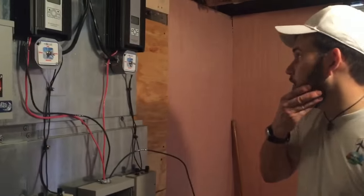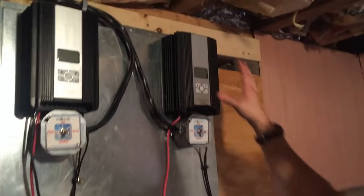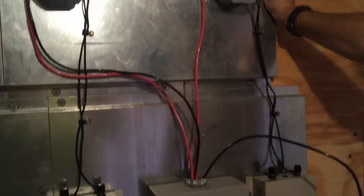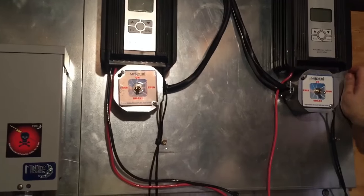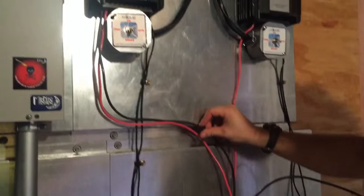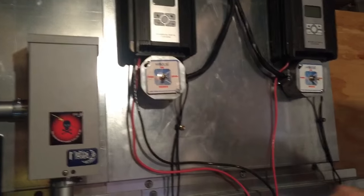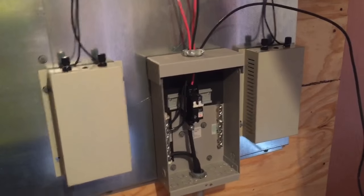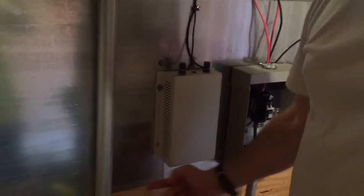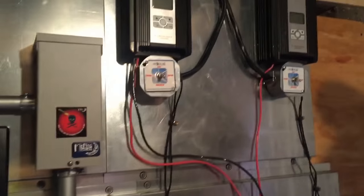Now, what we've got going on right now is we've got both our charge controllers wired and our brakes are on. As you've seen on the roof, turbines are in good shape. We'll tighten these down and lock this down. Our dump loads are in place. I'm putting the last wire up here — you've got your hot and ground coming in, and here it is to our lugs. We're going to take a ground, come over, bond, bond, and out to the grounding rod. Everything else is pretty much either isolated or grounded. We're at the finish line on this, and I'll show you it operating in just a minute.